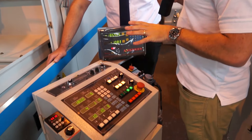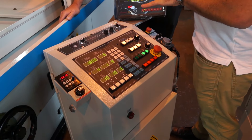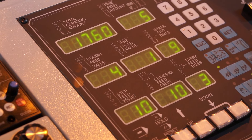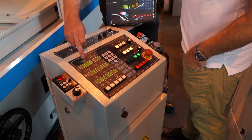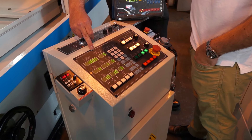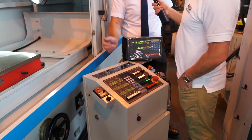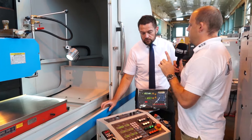That's a point I wanted to talk about because that is where this NC control below me here comes into the equation. How would this work? It's a very easy control to use. The operator basically comes down to the job, touches the top of the job, works out how much he wants to grind off the material. He can then put in the rough total number of passes that he wants to do, the fine feed, the roughing feed, and how many spark outs he wants to undertake. The control works it all out. The operator can then shut the door, press cycle start and walk away. Simple as that.